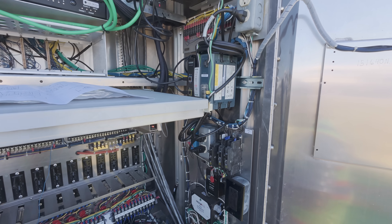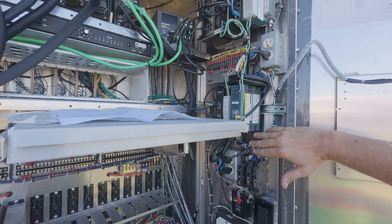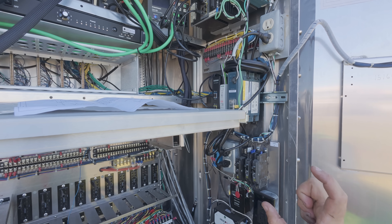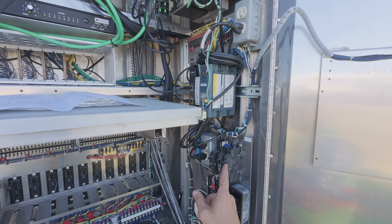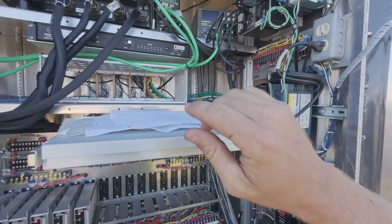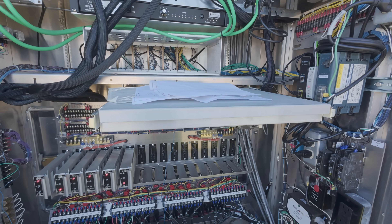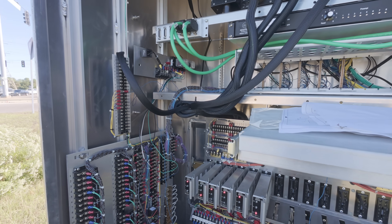They stacked both of them, really. I don't love that to begin with — I feel like that should come out. Maybe they should have a terminal block and then the cables, like a terminal strip for the breakers. They've got too much stuff landed into each breaker — I've never loved that. The more of these cabinets I do, this used to be one or two cables each and now it's more and more going into it. Let's do a little bit of cable management to get this stuff looking nice and tight.